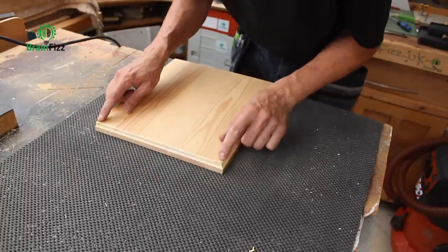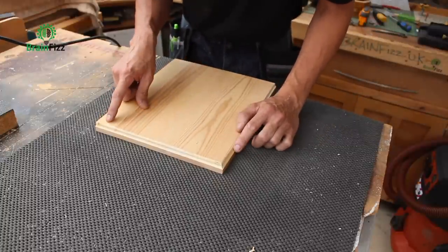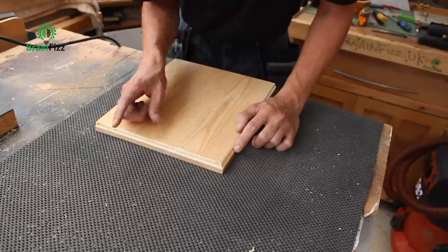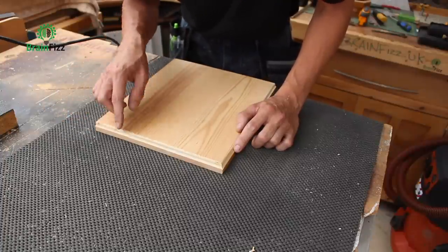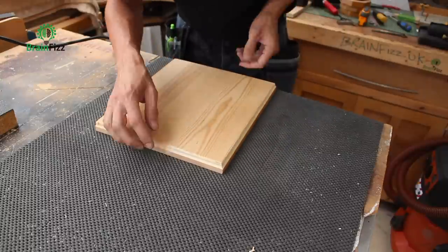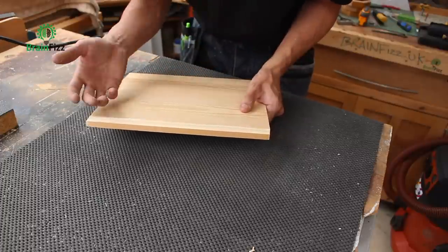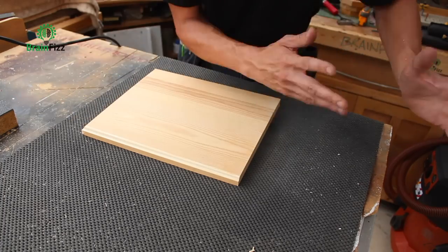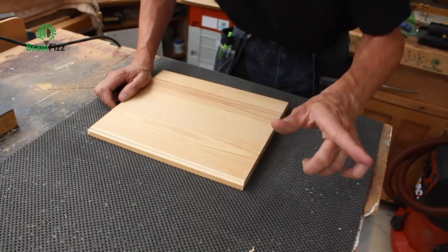There's a little bit of burning at the start and finish of the line. That's not to do with the cutter — that's purely my feed rate. As I start on the edge I'm going more slowly, building up friction, and the same as I approach the end. But as you can see on the end I've kept it nice and clean. That's to do with feed rate — the speed at which I'm moving the machine. We'll go into those in another video.